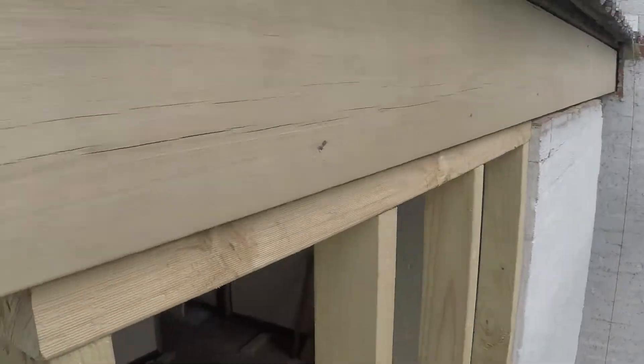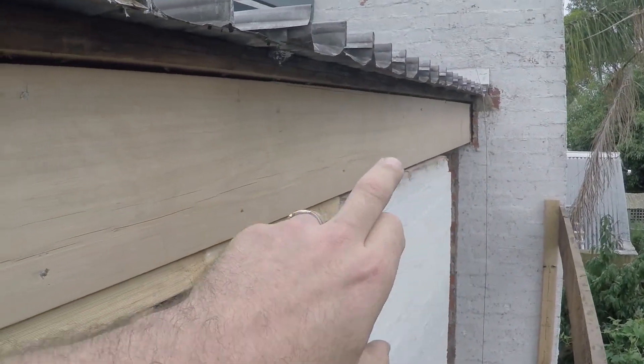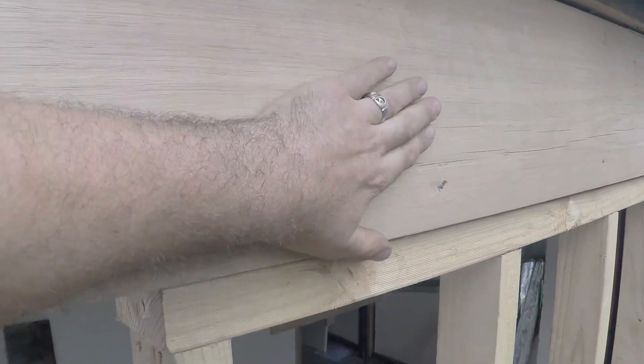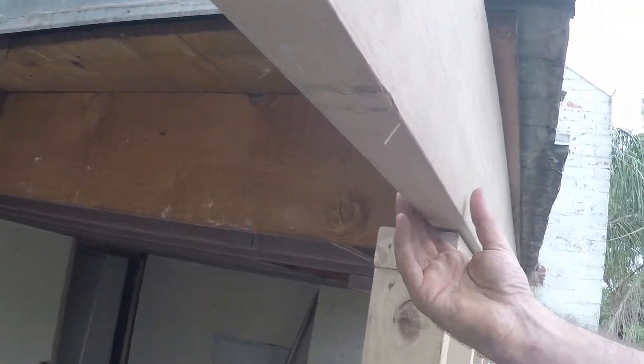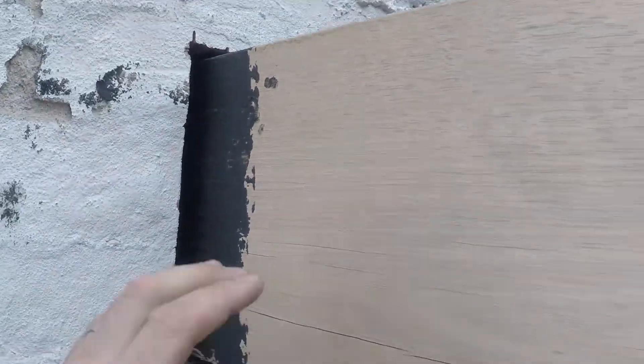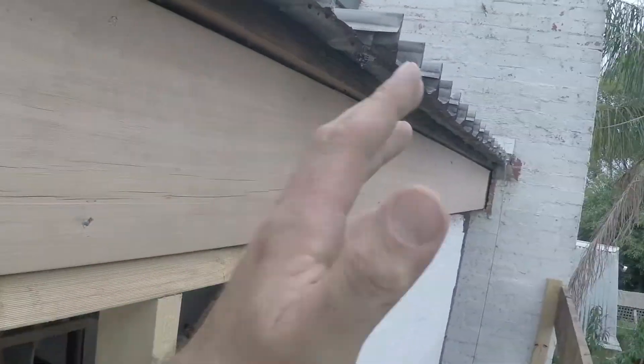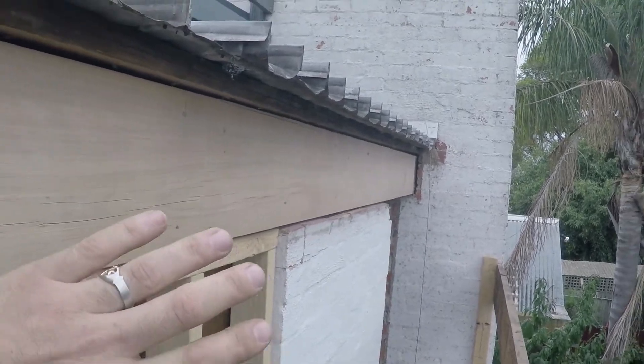The difference between LVLs and hardwood — you will need to have a look at our video on the uses of them for internal and external use. What we have done is installed a hardwood beam, and this is going to be used on an external face. It will be covered, but it's gonna be used on an external face and it will be behind or inside a wall, but it's going to be exposed for a certain length of time. Due to that exposure, if this was an LVL, this would actually swell slightly, and it'd change some measurements inside that we've got for our rafters and things like that, which is what we don't wanna do. So what I've done is installed a hardwood beam that spans the whole way through, Tony, just to make sure that we don't get any major movement.